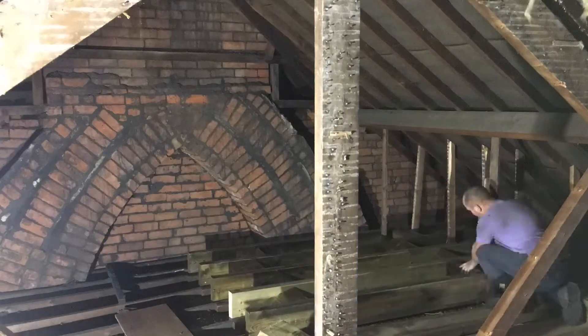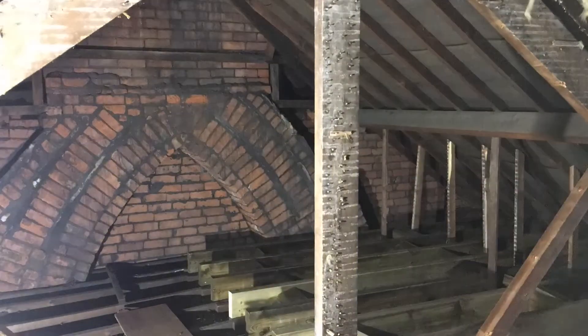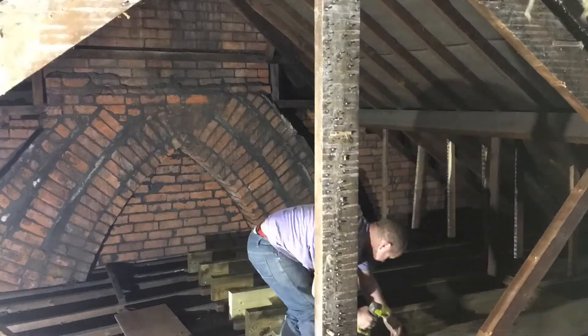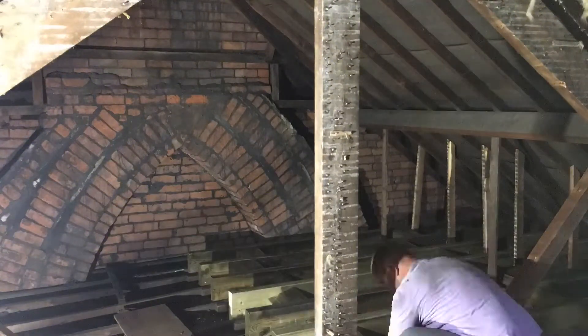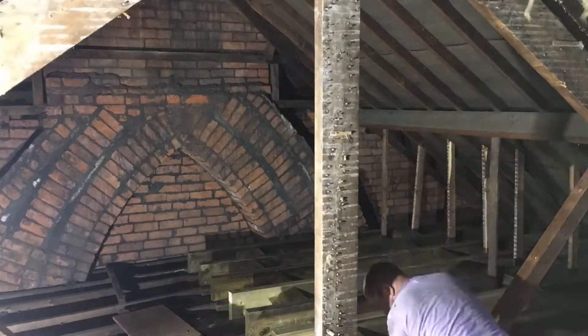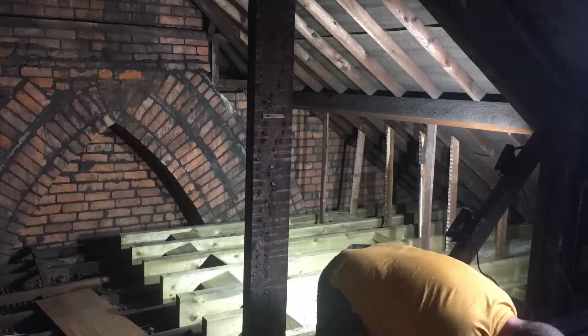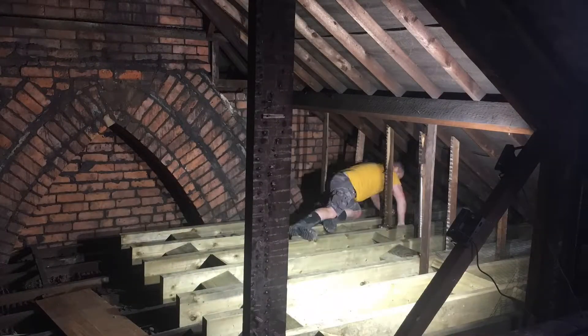You can see me now laying the beams up on their edge and putting noggins in as I go. That's why I got all the beams in first — I could stand on them more safely than on the old ceiling and do the work. Noggins are going in right now, and there's a little cheer for that.